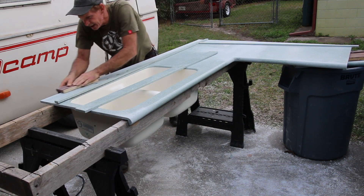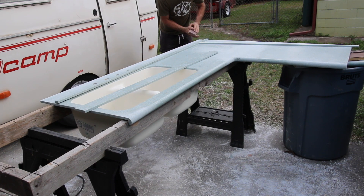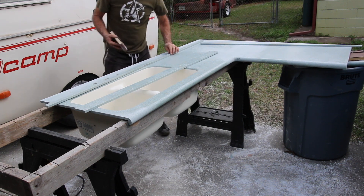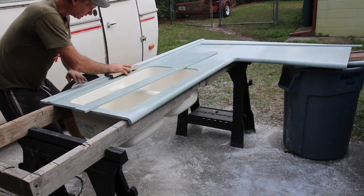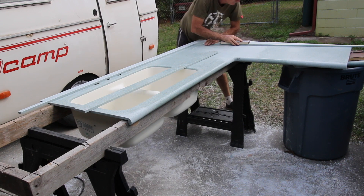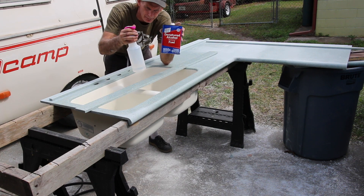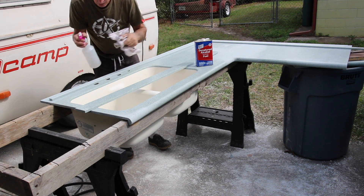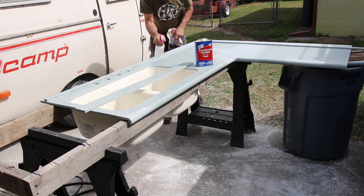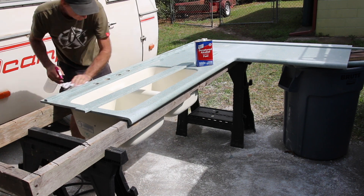You want to make sure the surface is scratched up really nice with some 80-grit so that it sticks, and do your strips as well. I'm just going to do the one side right now. Take some denatured alcohol, put it in a spray bottle — that'll remove all the dust and pencil marks. Just soak it down; you want a good surface.